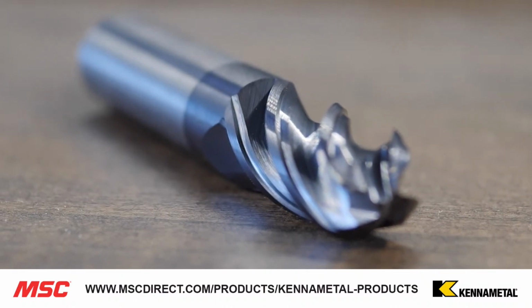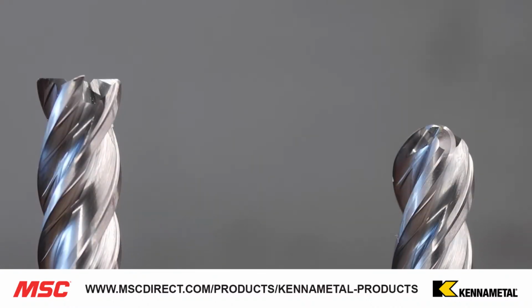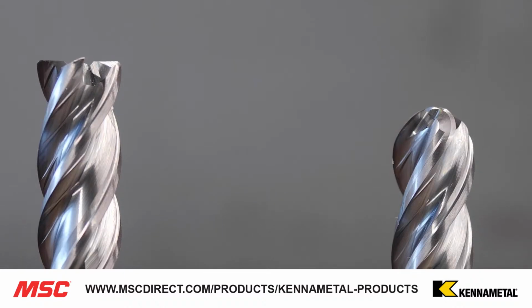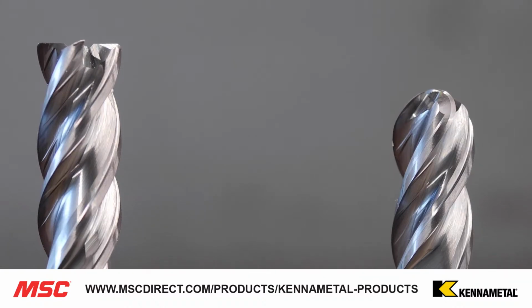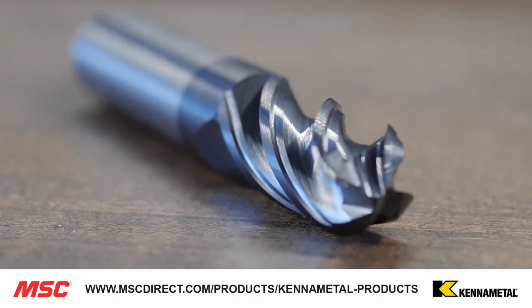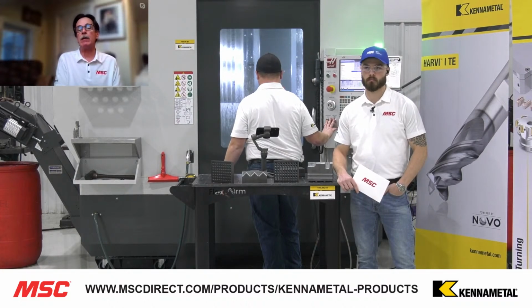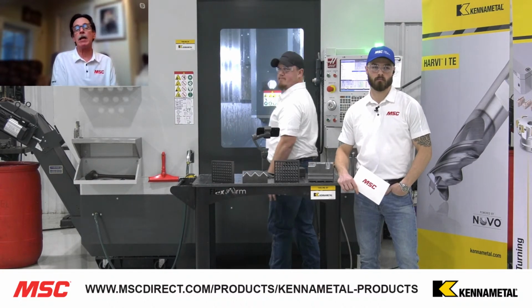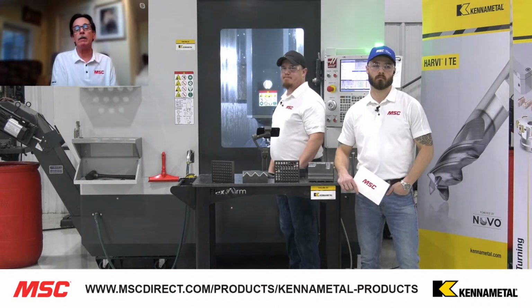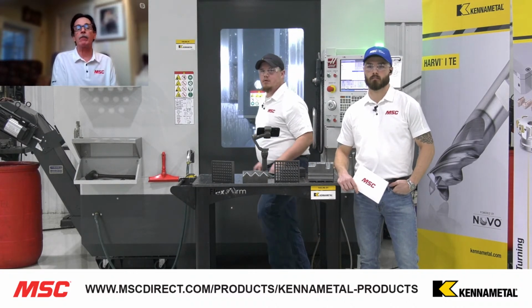Well, the tool life, some of the tricks in the design, like the chip gashing, which is patented in that flute. The way that's configured, it allows a lot more coolant to the edge, and it just changes the way that chip forms and flows. And anytime you can keep that tool cooler, it's going to last longer. Wear is in fact friction and heat.